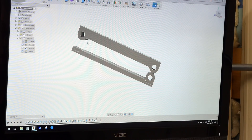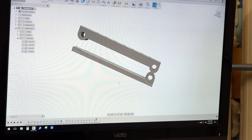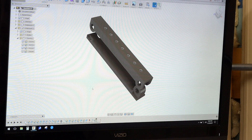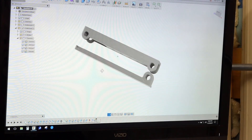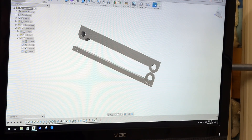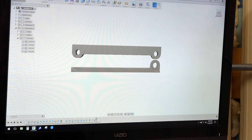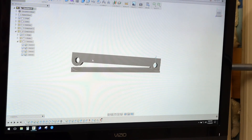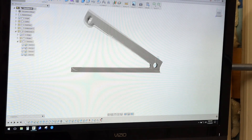I've got a lot of ideas for how to use this. In the design, I always like to put screw holes in the top — these are 10-32s. They work well not for clamping parts down, but for making stops. If you've got multiple parts and you want to cut the same angle consistently, you can slide the part up against a stop and position it. Here's the front view assembled with the pins in — that's the pivot action we're going to have.